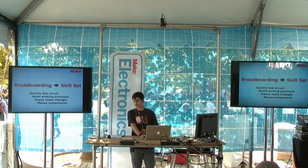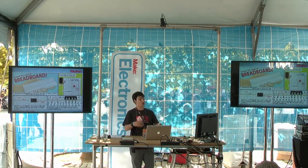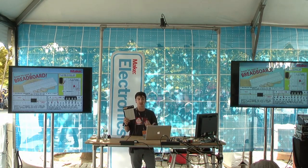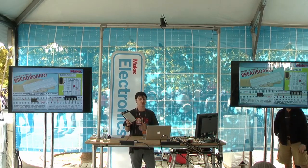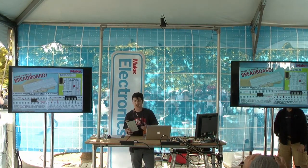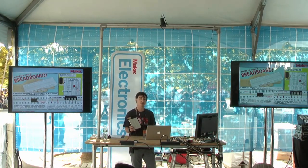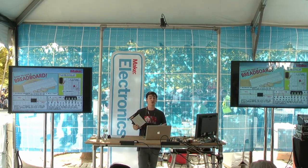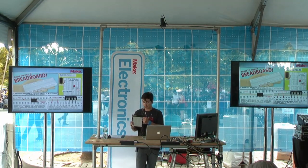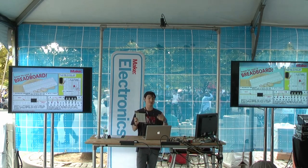Let's roll into the details of the breadboard itself. Here's a great illustration that one of our illustrators, Jody, did. A lot of breadboards are rectangular or square in shape — they vary in size. Here's one of the larger breadboards I've found. I love having the extra space even for simple small circuits. As you can see in the illustration, there are a couple of rows and a bunch of dots on the breadboard. The lines on the sides are your power rails — that's where you input your battery power or power supply. There's no hard fast rule, just conventions: you'll see a positive and a minus terminal. It's ideal to use the positive terminal from your battery to go into that positive line, and all the terminals in that vertical row become live with electricity.